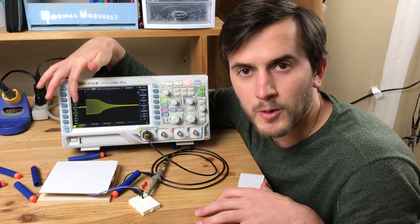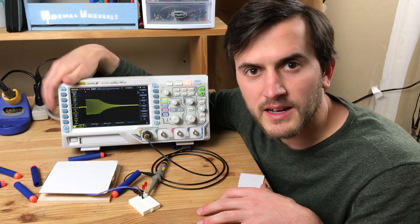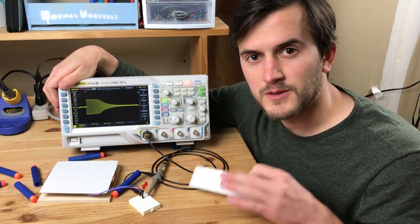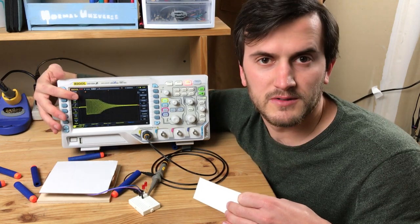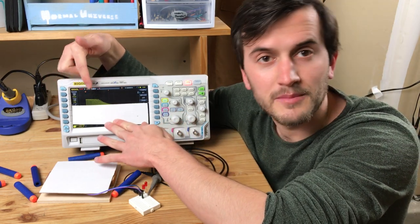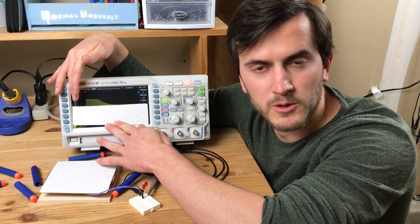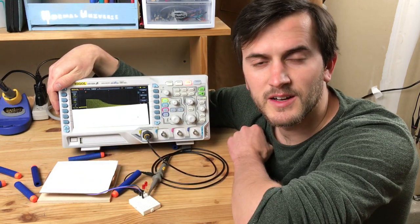And we can require that the oscillation happens very quickly at this kind of speed in order to reject finger taps. And one quick caveat is we gotta remember that the Arduino can only sense voltage from 0 to 5 volts, and this is oscillating between -2 and +2 volts. So the Arduino basically will see this. It'll only see the positive voltages in this signal. But I think that's fine. We can just count the number of peaks where the voltage climbs up. So now to program the dart sensor, we'll go to the whiteboard.